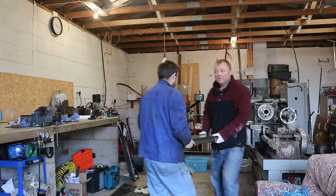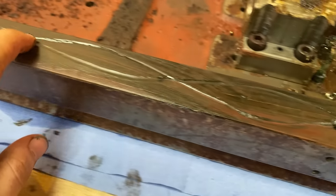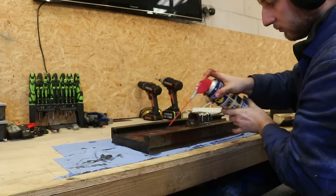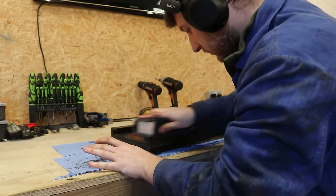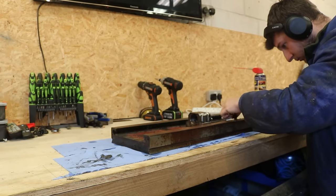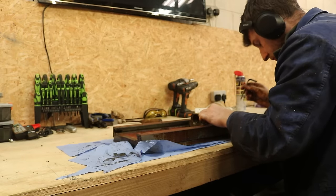With the X-axis fully off the lathe, it's clear to see the Turcite strips on the bottom are completely ruined at the back. And I have a sneaking suspicion this is what was jamming the axis. Then again, this gets a cleanup, with the worst of the Turcite cut away until I can get it replaced. The ball screw yoke and ball screw nut can then come away, but you'll just have to trust me on that last part.